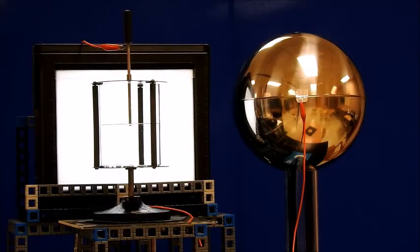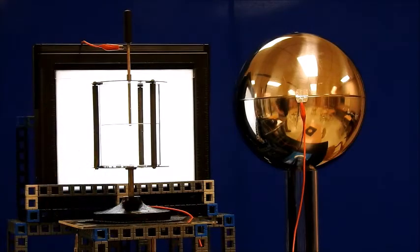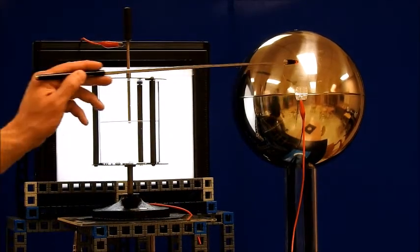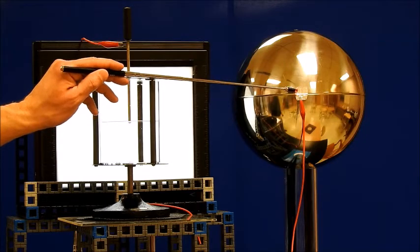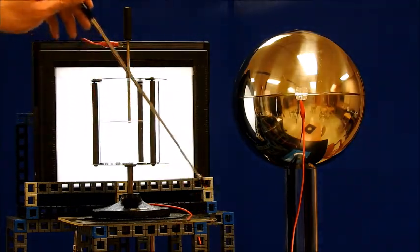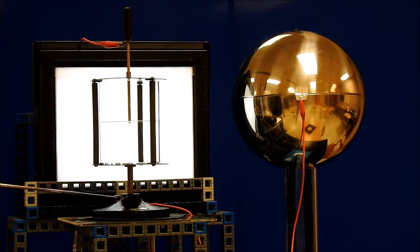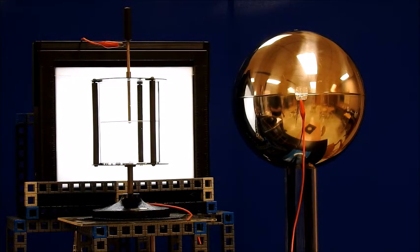This is a voltage hail storm. We're going to use our Van de Graaff generator here to collect charge. I've got a piece of metallic tape just on the edge of the top half of the dome that allows me to route that negative charge to a clip back here on the metal base, there's a metal post, there's a metal plate. So all of this is going to be receiving the negative charge from the Van de Graaff generator.